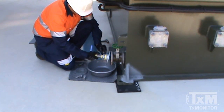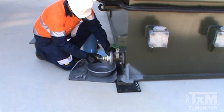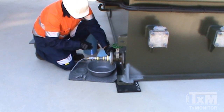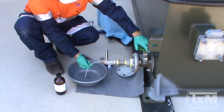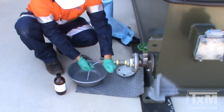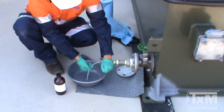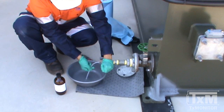Install a flange adapter with an on-off ball valve tap and silicon tubing to the sampling port valve. Ensure that positive pressure is obtained. Proceed to flush the valve adapter and tubing with a half to a full litre of oil into the waste container.